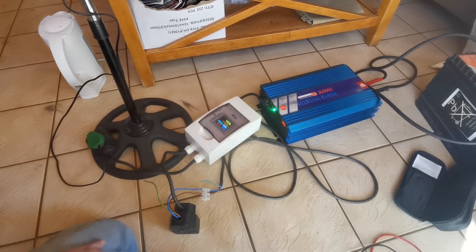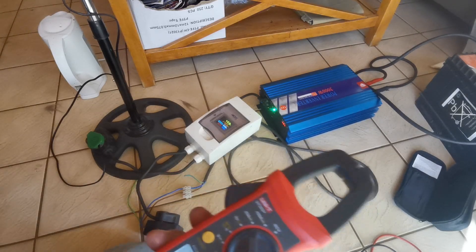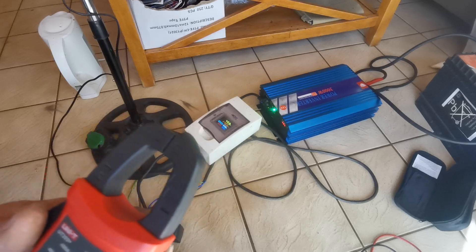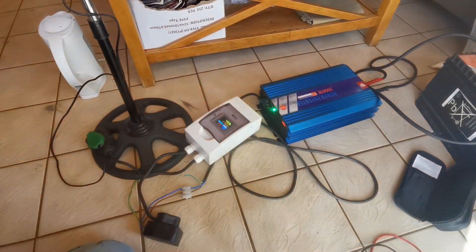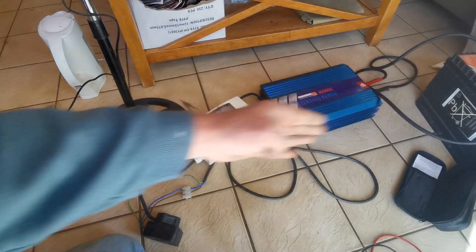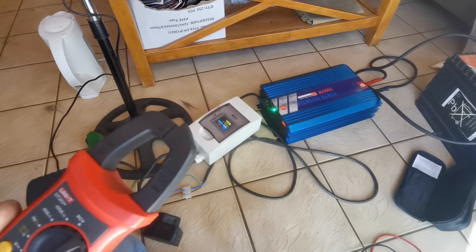Why is this useful? You want to see how much current a device is pulling in a setup like this. It's pulling 5 amps. If you've got a 100 amp hour battery, you can only bring it down to 11.8 volts — how many hours are you going to get? And if you've got a 5 amp charger and you use the device for one hour, you're going to have to charge it for one hour to get it fully back.